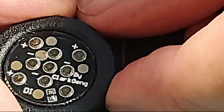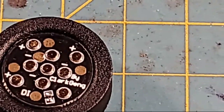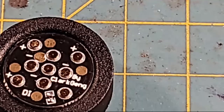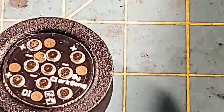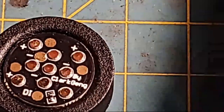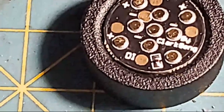It looks like there's a resistor in there, but if we're not sure, we can always measure the impedance. So I'm going to measure the impedance across there. Put this thing on 2000. I'm going to zoom you guys back out, I hope.